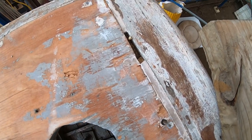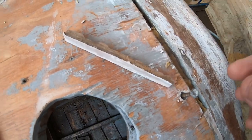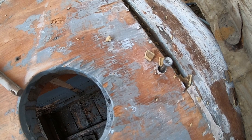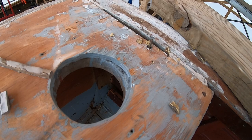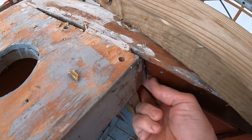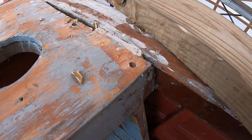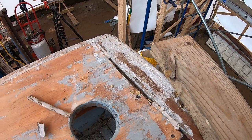This area is obviously separated, causing it to need all this filler. Not quite sure what that stuff is — it's either separated or it's just a really badly cut piece of plywood, with more sheetrock screws. This looks like an area we might have to deal with, because it doesn't tie in very well right here — you can actually separate it with your hand. They had just a little L bracket here, but we've got to do better than that. Maybe put a piece of board underneath and kind of fish-plate it.